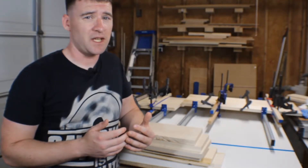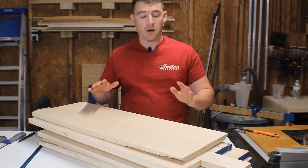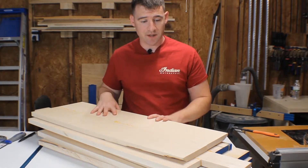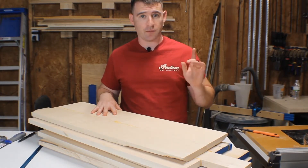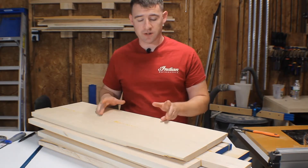Right here, there's a joke everybody likes to make about clamps. Just please, could you not? Alright, here we go. I got everything all glued up. I'm going to get all 10 pieces out of this. First, I'm going to go ahead and run it through the table saw, get it down to its final width, which happens to be 12 inches.